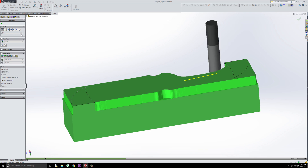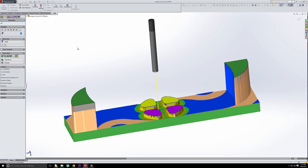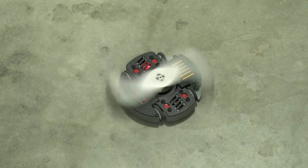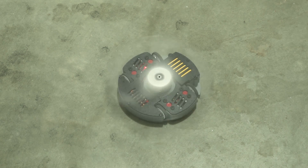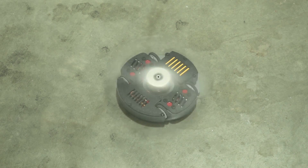The blade was a little unbalanced when I was done, but I mostly chalked that up to issues with the actual machining. All I needed to do was put a rod through the middle hole, balance it on a couple of blocks, and I could easily tell if it was unbalanced by which side dipped down. This side ended up being a little bit heavier, so I drilled out a little bit from the end, put it back on the stand, drilled a little more, and kept doing that until it was relatively balanced. Every couple of steps I'd put it back on the actual robot, spin it up, and by the time I was done you could tell it was pretty well balanced.